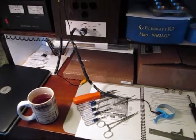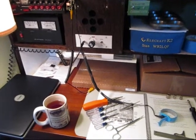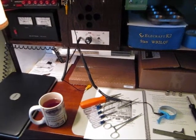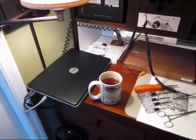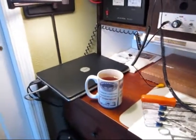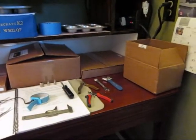Don't forget the 1M resistor in series with the wrist strap, by the way. Sometimes you buy these wrist straps and it's not included, especially some of the cheaper ones from China. Your computer's off too. I don't want to be disturbed by email and other things. I want to turn my attention to all of this assembly work and try to keep all the hardware straight.